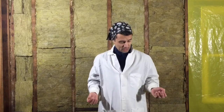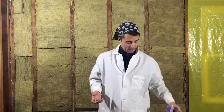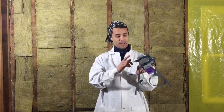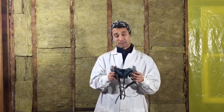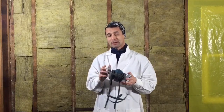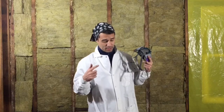You'll also need some kind of respirator. I have two different types here — I have a half mask with P100 particulate filters, because I'm also dealing with asbestos and lead in this house. But if you're just installing fiberglass, you probably don't need anything quite that heavy duty — N95s or something lighter is probably fine for mineral wool.